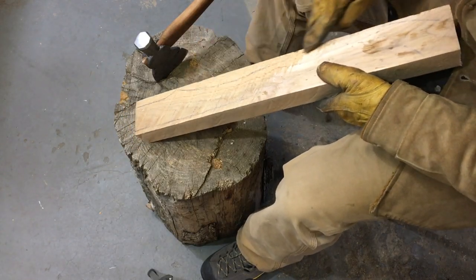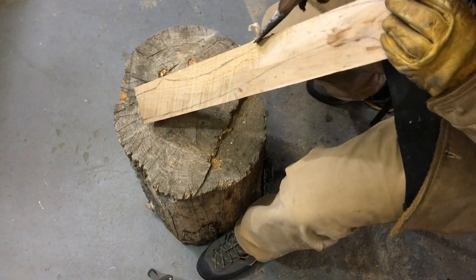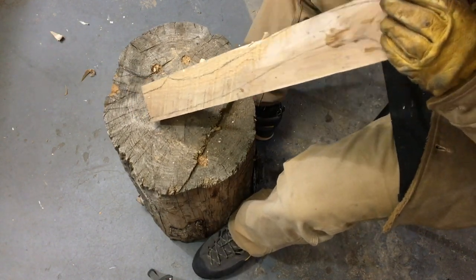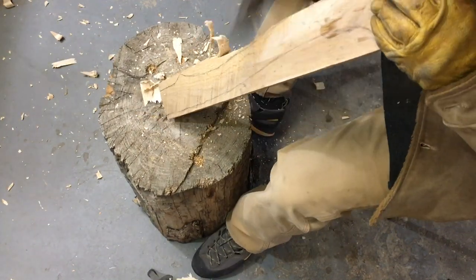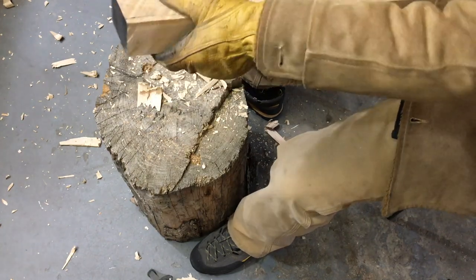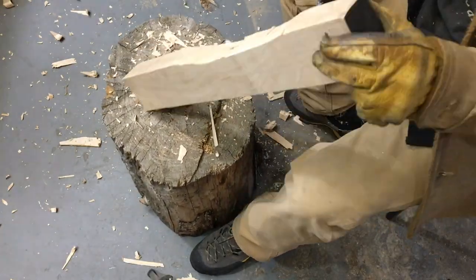I like to try to follow the grain. You can see where I've drawn it out. This first step in carving out the axe handle is to get the general shape. I've got a block of wood and now I just need to start carving it out. I normally start on the edges and then go to the center. I try to work with the grain so that it doesn't chip up in the areas that I'm trying to carve. I'll flip it around and start carving the other direction, so that with the grain of the wood, I don't chip out the sections I want to keep.